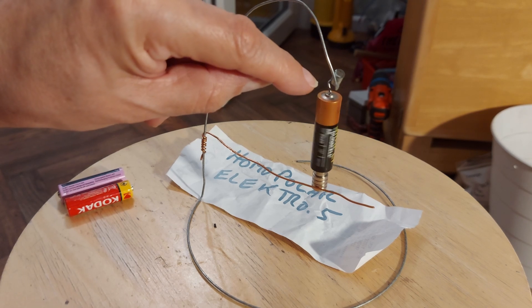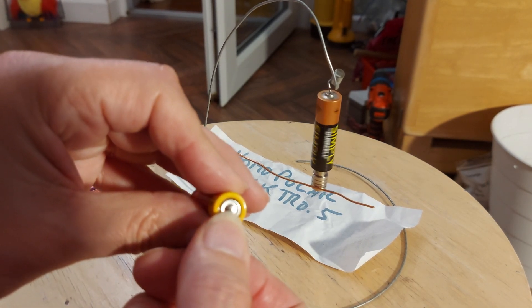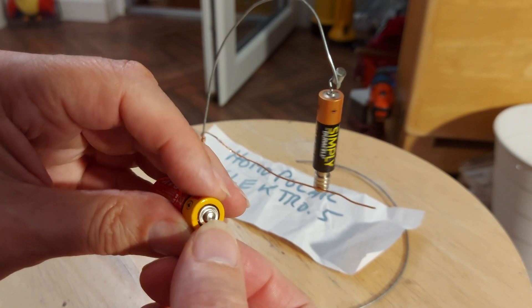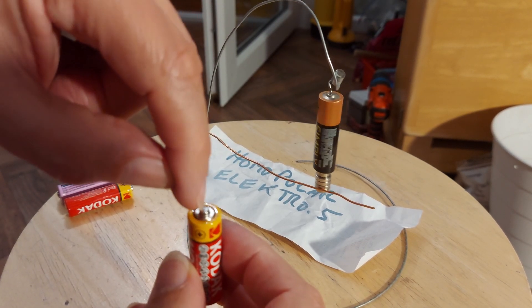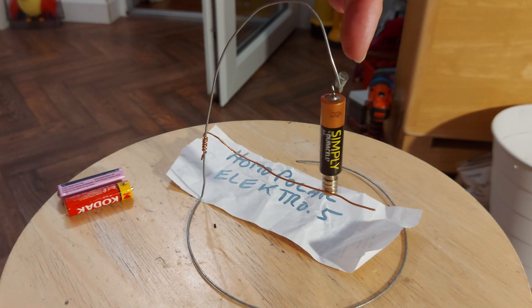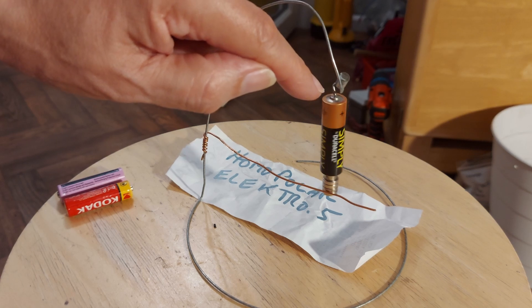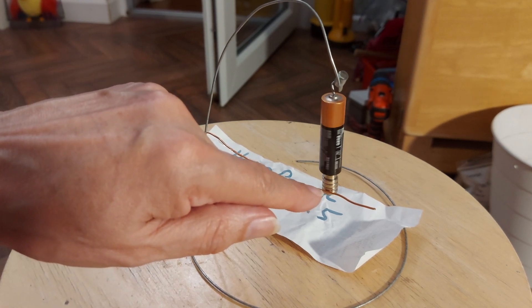I sharpened the point at the top, so that's reduced the friction. I do remember when we've done them before, you actually make an indentation in the top there — this one's got a little nipple pointing out. Whereas if you just tap a nail in there to make an indentation instead, the point of your bearing goes into the indentation and holds it in the center, because this goes off-center if it runs for long enough. I've got some magnets at the top there that are magnetizing this steel wire so that the battery is actually attracted to the point of the wire — that's the bearing surface. And the current flows along the copper wire and makes contact with the bottom of the battery through those magnets.